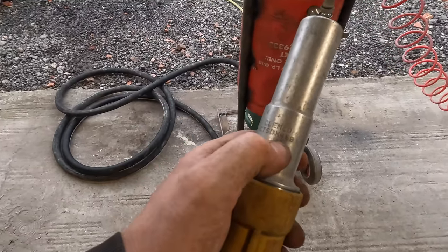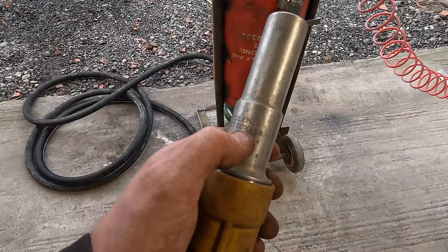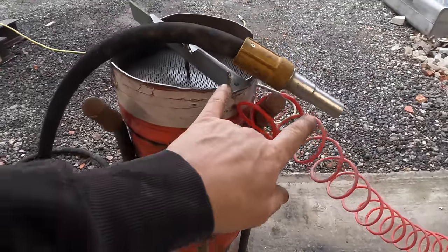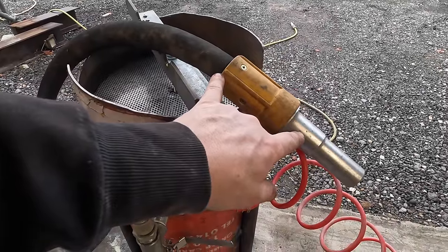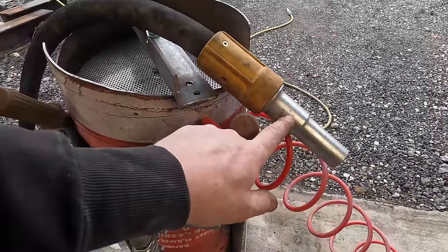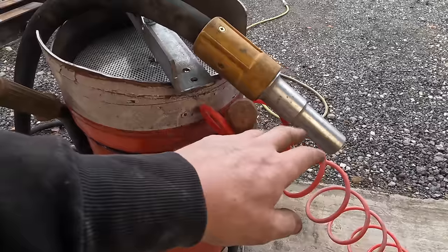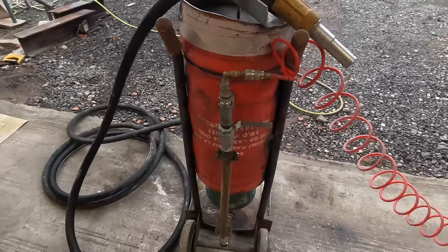I'm just a bit disappointed that I haven't got a smaller nozzle. I thought I'd got a 2. But they're into 2, and I think a 2 you'd still need at least 50 CFM. So I believe you'd probably end up using blast cabinet pipe and a blast cabinet nozzle, which will probably be a lot smaller. See, that's a 4, so hashtag 4, which is a CDX450, that's the Clemco part number, which is quarter inch diameter.